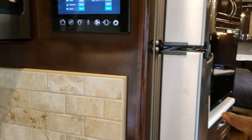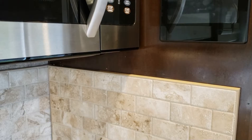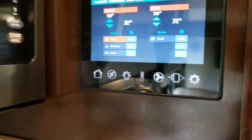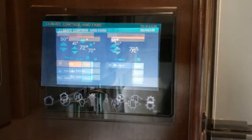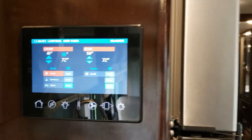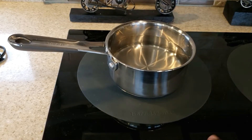Now let's turn on the refrigerator, then one AC. We're going to wait for that compressor surge. Compressor just came on. Now we're going to turn on the cooktop — starting on 8 and going all the way up to 10. We're trying to get to the 2600 running watt limit and see if the compact 3200 can handle it.